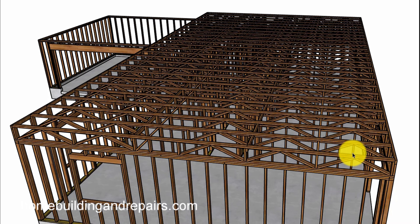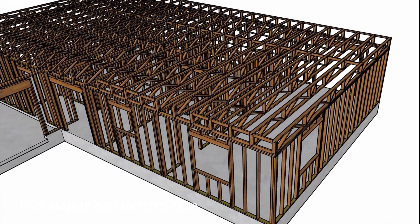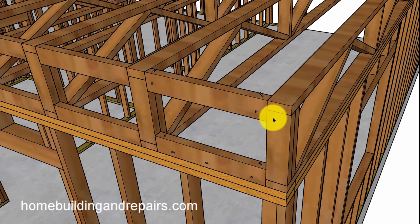But what if they aren't shaped like that? If you're not going to have a joist that you can nail a 2x4 to the face of, then you're going to need to put blocks in between them. I'm giving you an idea of how I would nail them to the truss joist. Again, these bottom blocks might not be necessary — you're going to firmly attach these to the framing plates with a couple of toenails on each side.